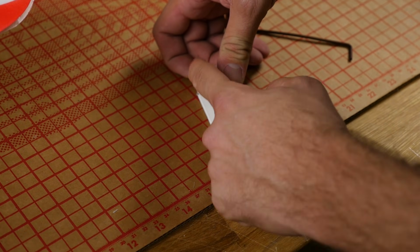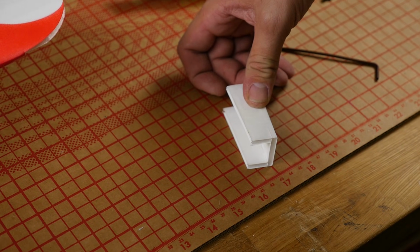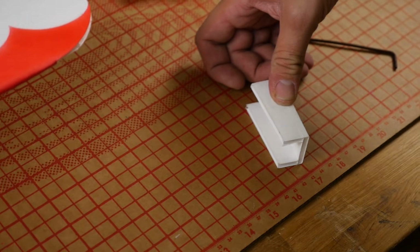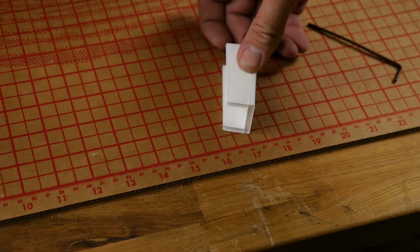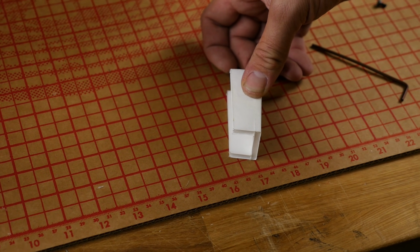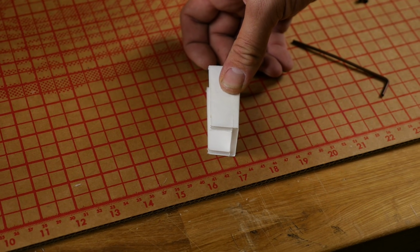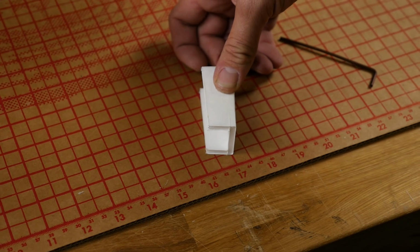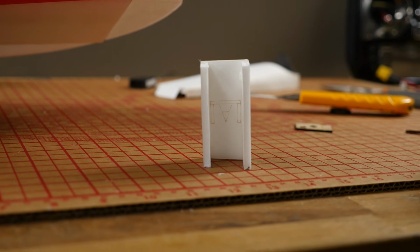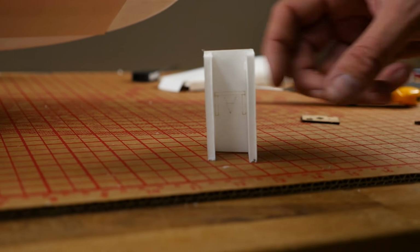The reason why this has a bevel on the very top here is so we can get the proper down thrust. Now this is still compatible with other swappables, but other swappables where it has neutral thrust or a pod that's square, just make sure you align the original pod appropriately. Most of these swappables require down into the right. So you can see now we're going to have down thrust and we're going to have right thrust. You can see it sits in a slight angle.